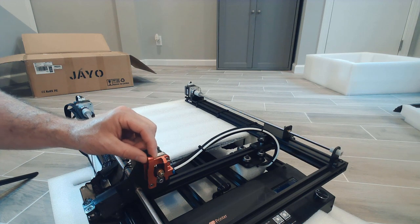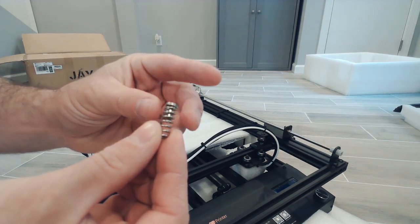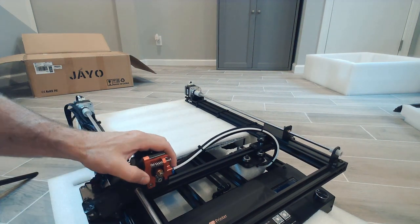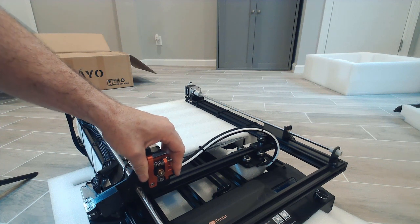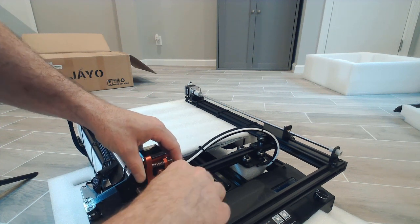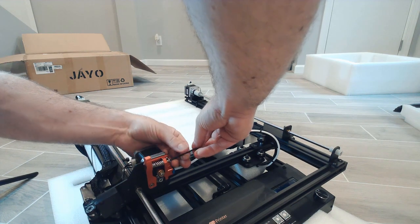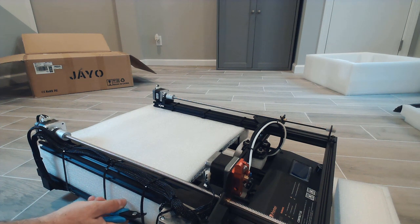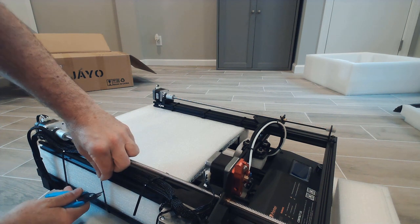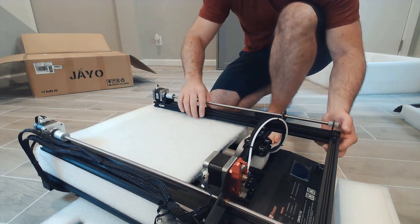After the arm is put on — the extruder arm — here's the spring. We put that little sheath inside the spring; that's what helps tension it down with the screw in the extruder. You put that onto the arm between the tensioner arm and the actual extruder, and then tighten down that screw. You're going to want to put some pressure on the arm as you're tightening that screw down. That tension of the spring is what puts tension on your actual extruder arm.